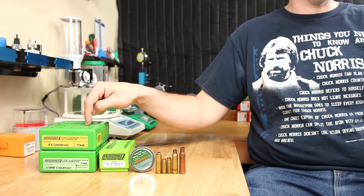Something else worth mentioning is choosing the wrong die to size your brass. If you choose to neck size your brass, that's your decision, however not for an auto loader unless you particularly enjoy clearing jams. Knowing what die is best for your application is important, so check out this video right here where I cover all the different sizing dies and how they compare. Thank you so much for watching and until next week, stay safe in small groups.